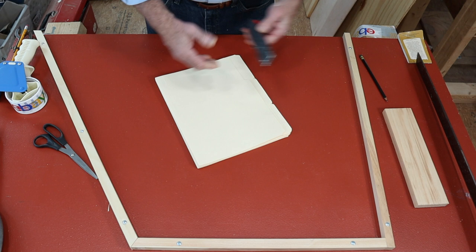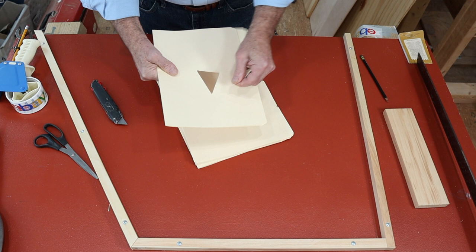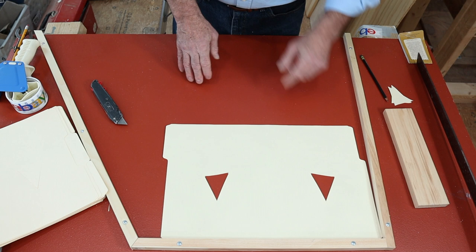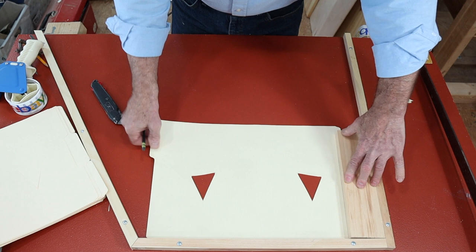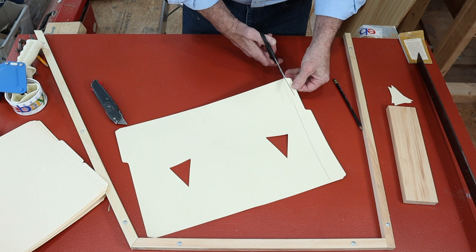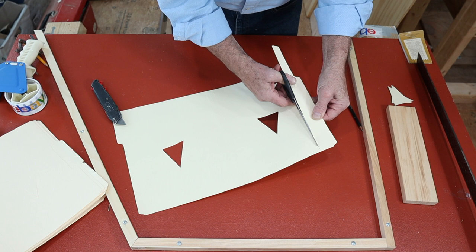The first thing you need to do is take a utility knife and cut a triangle out of your file folders just like that, and then lay it in place. You'll see that it fits perfectly on one side but not the other. So to get a good coped-in fit, I can scribe it with my compass, or you could use a block of wood — we'll move this over a little. You could use a block of wood like that, and then cut with your scissors.